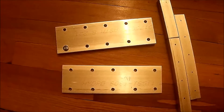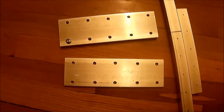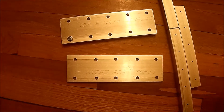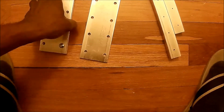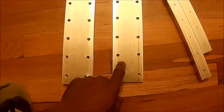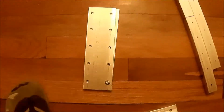It's definitely blowing — so that's how I'm discharging. While I'm at it, let me show you my bus bar configuration. I'm doing a series-parallel setup — four in series and five in parallel, so a 4S5P pack. These are my bars: this one here is going to be the top connecting plate, and this one is going to be my bottom connecting plate to link it all together.